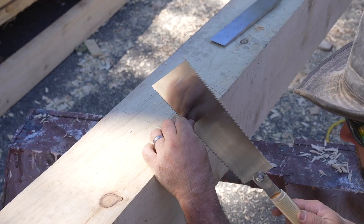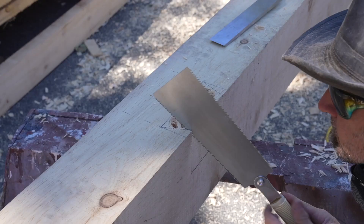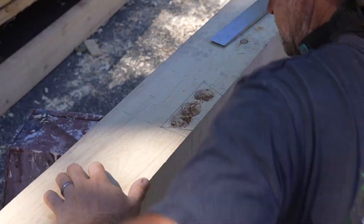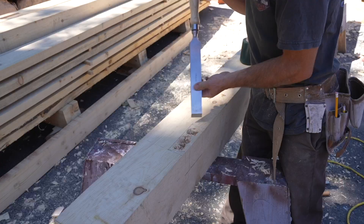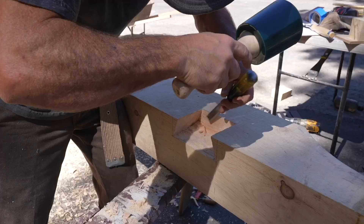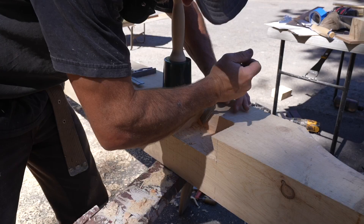My design required a few basic joints to be cut. The first is a dovetail that connects the side girt to the horizontal back beam. The depth of it was limited due to the concrete anchor hardware. I cut the joint a little loose and planned on wedging it during assembly. I sped the video up by 20x — cutting stuff by hand takes a lot of time but it's pretty enjoyable work. The dovetail shape made it a bit difficult to cut the back fibers of the mortise, so I flipped the beam on its side and used a smaller chisel to work the corners. At one point I experimented with routing out the waste but that didn't work too well.